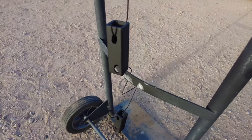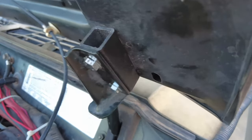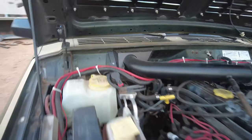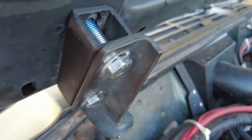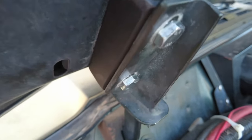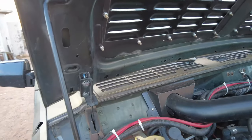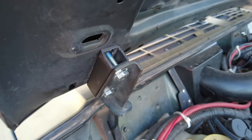I got the spacers hanging out to dry in the paint booth, and then it was time for install. The hood spacers are in — it was actually a little bit easier than I thought. The 1 inch by 1 inch tube is perfect. It leaves about a 3 quarter inch gap between the hood and the cowl. Ladies and gentlemen we are all done with this. I am extremely happy with it. I hope it does help with airflow — if it doesn't I might remove them, or just after summer I will remove them.